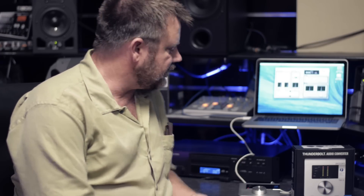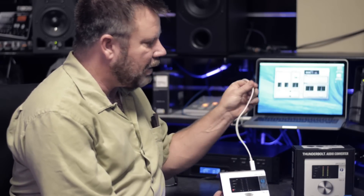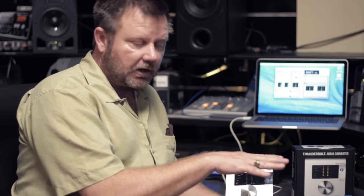The other advantage of Thunderbolt is this is the world's first bus-powered Thunderbolt audio interface, which means it's completely powered off the Thunderbolt bus. Thunderbolt has 18 volts of power versus 5 volts on USB. When you have much more current on the line, you can use much higher quality components. All the components in your audio interface run off the bus — the metering, the preamps, the A to D conversion, the D to A. We can use components that work on much higher rails, which means we have much more dynamic range and transparency in the sound.